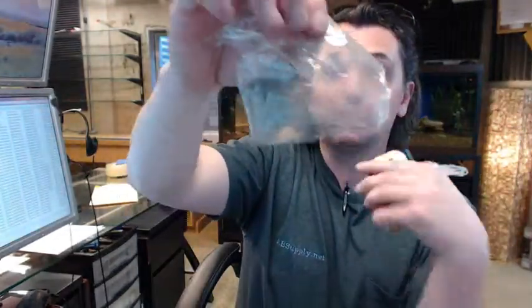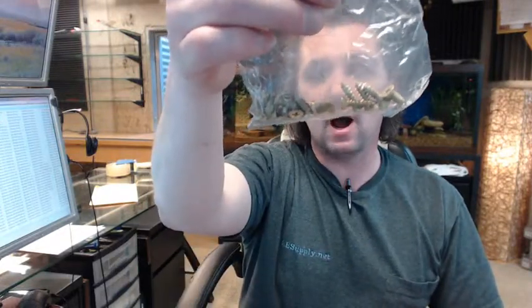Insert the tension rod into one of the holes. Turn it clockwise, and as you do that, you see that you reveal additional holes. It's into one of those new holes that you're going to insert a tension pin. This package has 2 tension pins. You only need 1 per hinge, but this order for the client has 2 hinges on it. So you'll insert one of those silver pins into one of those new holes, and that's how you set the tension. And you'll continue to modify that until you get yourself to a level of balance of the door not going too fast or too slow to solve the problem. You're going to get all wood screws, all metal screws with it in a complementary finish.